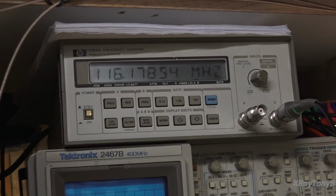So whatever it is, I'm almost wondering if possibly it is one of those JFETs, or possibly that varactor varicap diode is failing. Now I have some spare varactor diodes in stock, but of course we would have to look this one up and see whatever its properties are, because they're all different. The range of capacitance versus voltage and everything, you can't just put a random one in there. So I'm almost thinking something like that is causing our problems right now. So I don't know. We'll just have to keep troubleshooting, I guess.